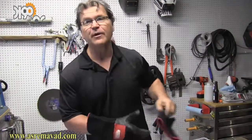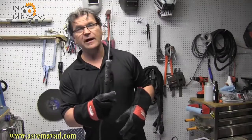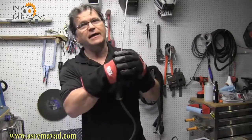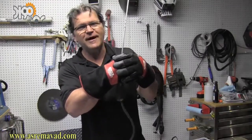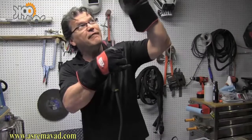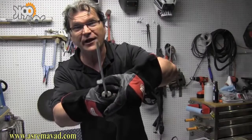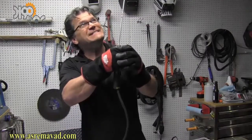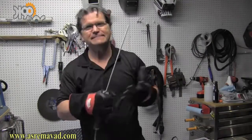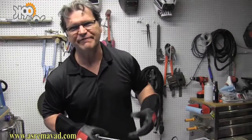Here's something that's happened to me before. For overhead tests like this, I used to chuck the rod in and get all propped and nice with my hands locked in — things going perfect — and then all of a sudden a big ball of fire comes down and lands right in all those little nooks and crannies on your glove. You're almost to the end of your rod, thinking 'I can make it,' and then you've got a half-dollar size blister on your knuckle.